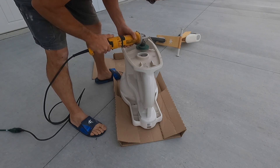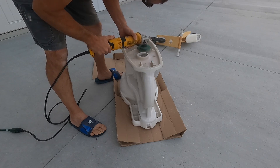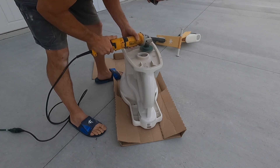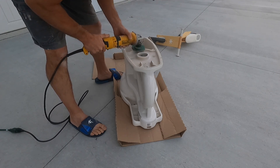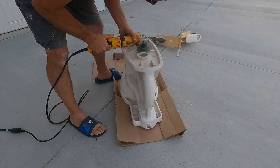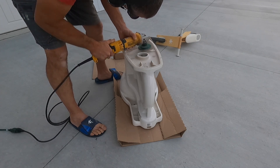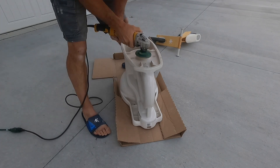While I'm doing this I really take my time, going really slow so I don't take any big chunks of porcelain. As long as you're using a diamond wheel you should have no problem. You're better off taking a little at a time, going and checking it, then coming back and taking a little more. Just depending on how unlevel or how much that concrete slopes up to your flange will determine how much you need to take off.